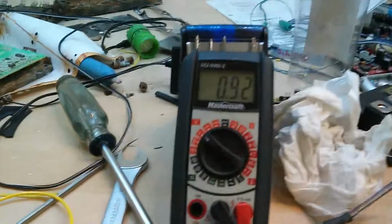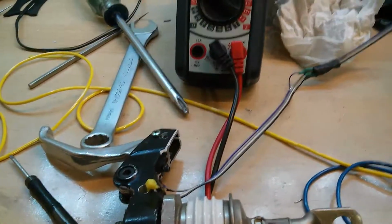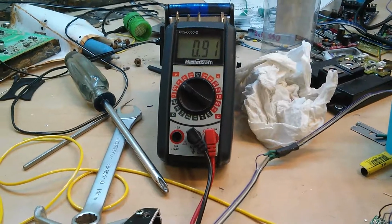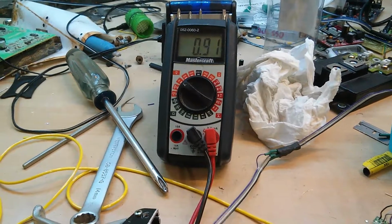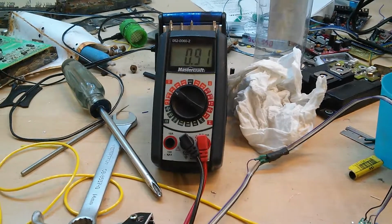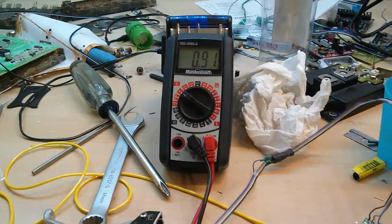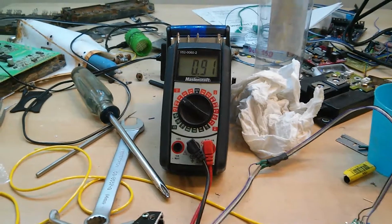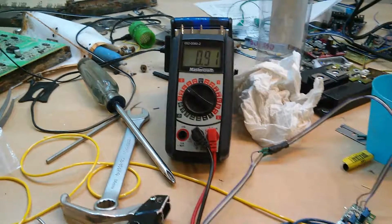So right now I'm probably going to set the Sevcon to start acting the regen just over a volt, and then have it go up to around 3 volts max regen. That would be set for, I don't know, I have to do the calculations of what the batteries can take and look at the max C rating and all that. I'll probably look at around 20 to 25% of the phase amps, which is 420 amps, max. And I think that'll hit pretty high regen numbers. Right now I got 4% throttle-off regen, which is actually nice. So 20% is going to be a pretty stiff brake, but that's full brake. So that should work pretty good.